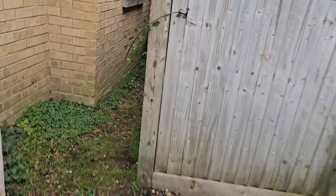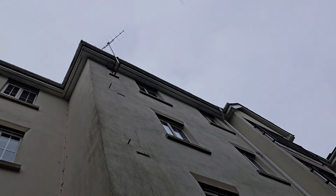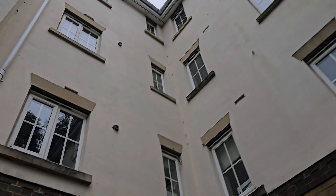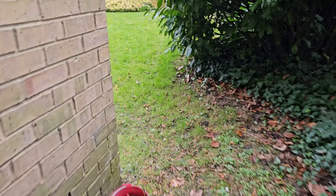There are a lot of flats. There's some staining on the wall but nothing leaking. We need to check all the individual flats if we can't find the stopcocks, to see if any toilets are overfilling or any taps are running. There's a lot of staining on the walls but nothing that's equating to a leak every 10 seconds — just a bit of moisture. We've done a loop of the flats and there's no sign of a leak anywhere.